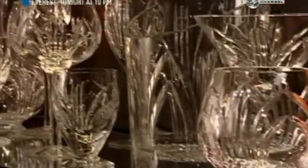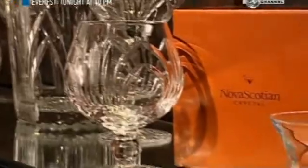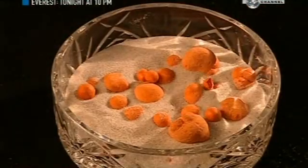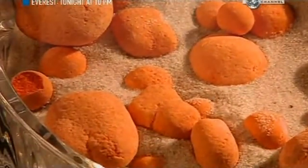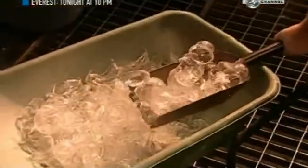Craftsmen start with silica sand, which is a very pure type of sand. Then they add nickel oxide to help the silica sand melt, lead oxide, potassium carbonate, potassium nitrate and antimony to give the finished crystal its smoothness, heft and sparkle. They compress the mix into pellets. They heat the pellets for 18 hours, creating a mass of molten glass they call the melt.